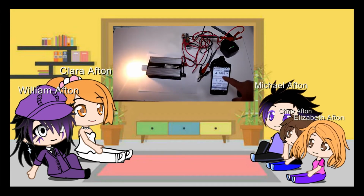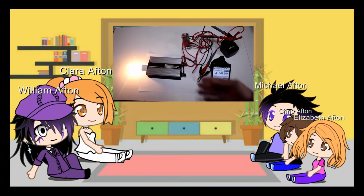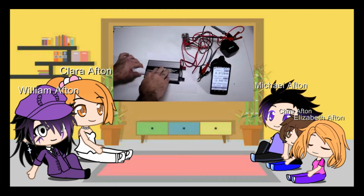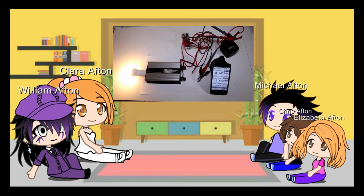Here we go. We have around 5 amps from the battery at 12 volts, which draws 60 watts from the battery. This is good but it drains my puny drill battery quickly. So instead I can use an LED light and you see it only draws 1 amp or 12 watts from the battery. So this is gonna last much longer and provides the same brightness.